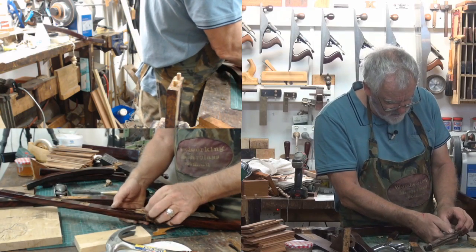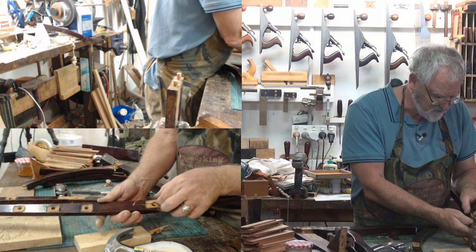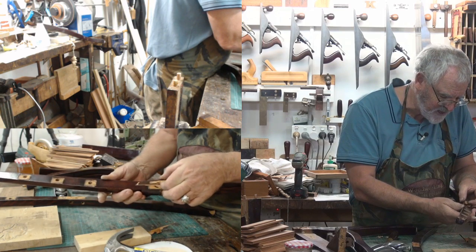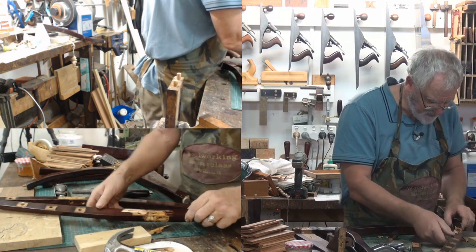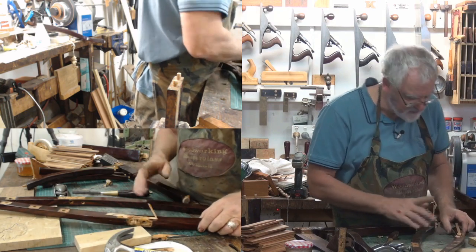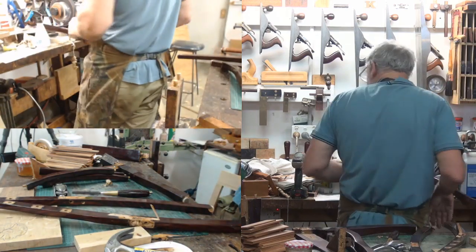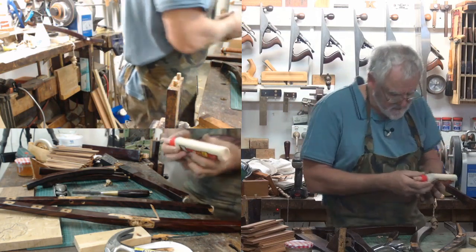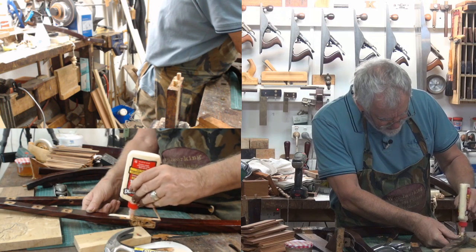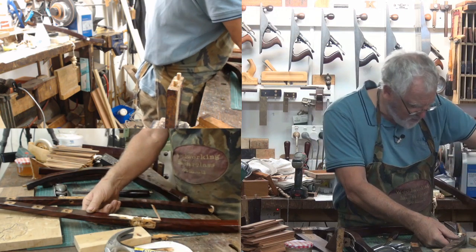And this piece here, that's hanging in there. I don't really, or will I? Yeah, I'll pull it out. Try not to bend those fibers, because when I go back in, I want all those fibers to line up. And that one will break, so we'll pull that up. Okay, get a bit of glue. The trick is to try not to disturb the fibers that have broken out, because then we can get everything to line up quite nicely.